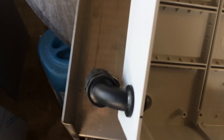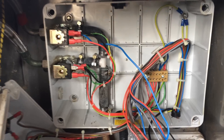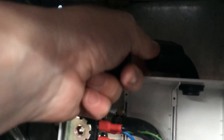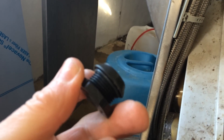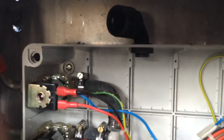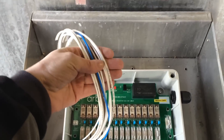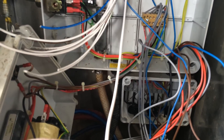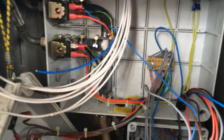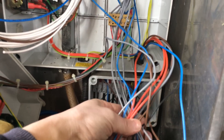Hopefully we're going to get all those cables up through there — I'm pretty sure we can get more down a 20mm conduit. Right, we've got that flexible conduit fitted in there. And we've got another hole here, so you need to get yourself a blanking plug — that's just a 20mm blanking plug with a rubber o-ring in there — and that will sit in the top in the second hole that we're not using. Right, we've got a wire pulled through. I'll put a spare one in there just in case — if we do run out, I can use one to pull two new ones in. There's not a lot of current going up there, so I'm not worried about them being packed in too tight; it's just more physical room.